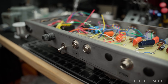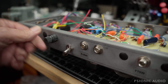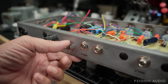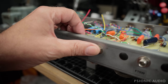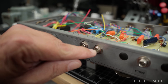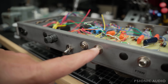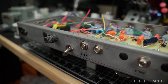All right, here from the rear view: the old power switch hole location is plugged. A new higher quality fuse holder. The new single-pole, single-throw — simple but effective power switch. All that's necessary. New speaker jacks here, both Switchcraft. This is a 12A and this is an 11. So this is the one that shunts the ground. Just like on a Princeton, this is the main speaker output, but if you want to run another cab in parallel you can do it that way.